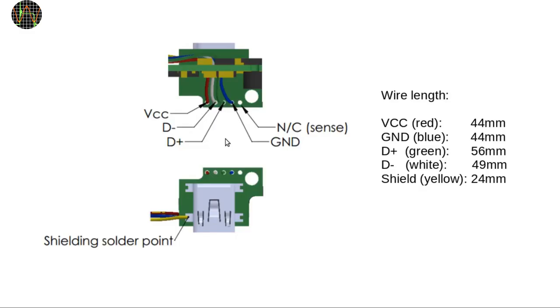The next job is to solder five thin wires onto the small board with a USB connector. These pictures are taken from the Kurokesu website. The wire length in the table is rather generous — I cut mine slightly larger and ended up with quite an excess, but it is still not a problem. The wires need to be quite thin; one way is to use the cut-off USB cable as a source. The colours are of course only a suggestion. Four wires are soldered on the corresponding holes of the PCB, but the shield wire is soldered directly onto the mounting point of the connector.